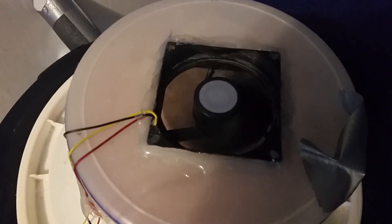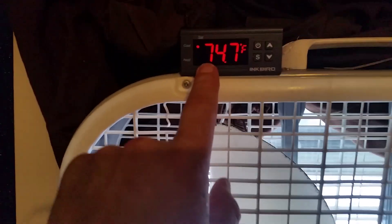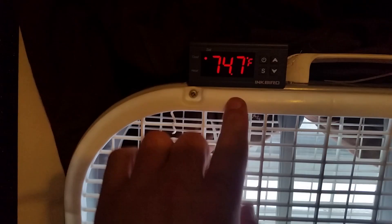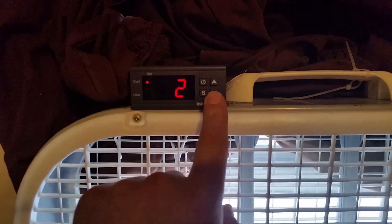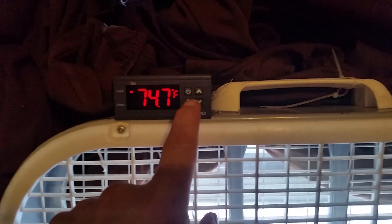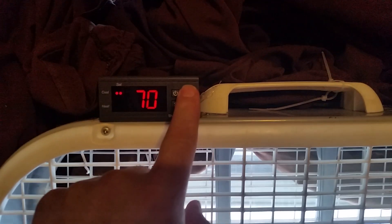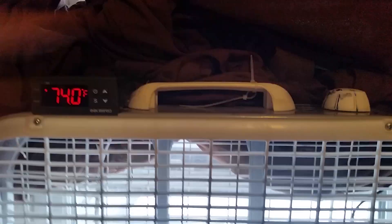Soon it'll have one of these — this one's for temperature, but I'm gonna get one for humidity that turns a fan on and off. Right now this is set to 69 degrees, within two degrees, so if it's two degrees above 69 it kicks the fan on until it brings it back down to 69. I'll be able to do the same thing for humidity inside — I want it to be 72 in here. This fan will turn on and off for humidity levels inside.